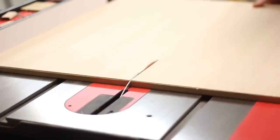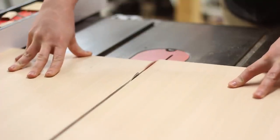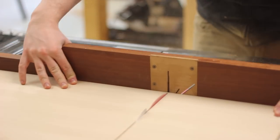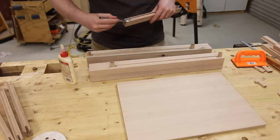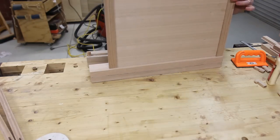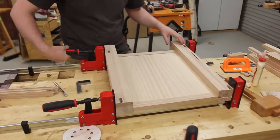The previously mentioned panels are the same Tassie oak veneered MDF that was used in the set of drawers. Both leg assemblies were glued at the same time but nothing else — if I were to glue all the rails and face frame together at once it would be almost impossible to get it all clamped up before the glue set and would be a real nightmare. In the end I think I had three or four major glue-up sessions.